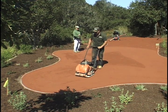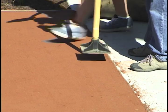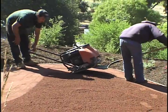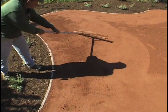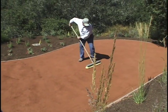Compact all edges thoroughly and repeat a minimum of two times with hand tamps if necessary. If you see ridges and ruts resulting from the compaction equipment, first clean the plate or roller, then use the flat side of an asphalt rake at 90 degrees to the ruts to break down and eliminate them. If slick or high sheen spots appear, then you have too much compaction. Use a medium bristle broom to break the surface and provide a more uniform appearance.